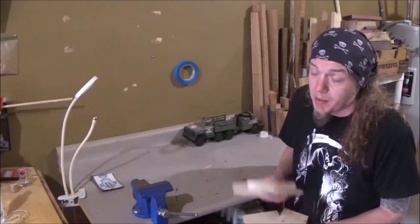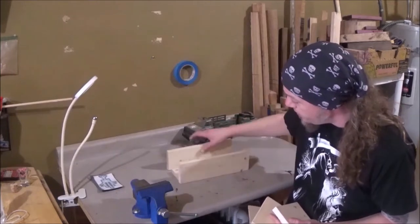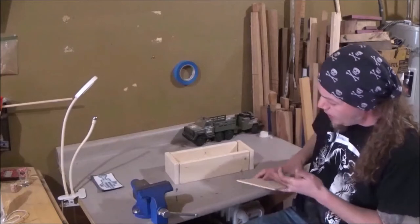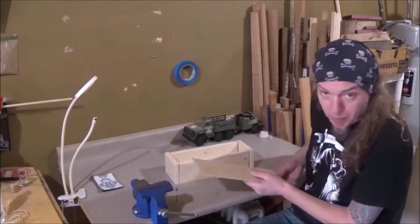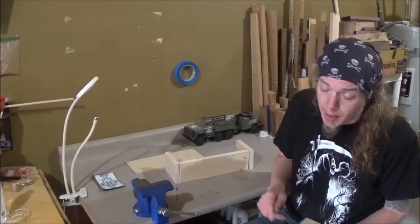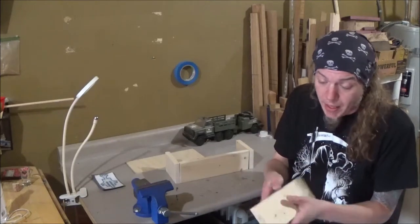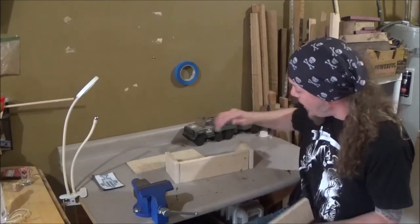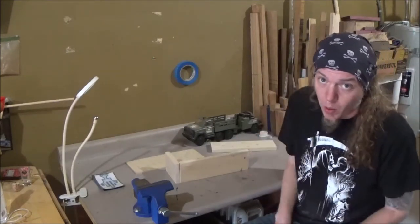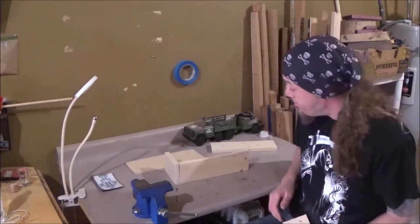So now that we got all the pieces, the basic principle of what we're doing is we're going to take these pieces of wood, set them up side by side, and put a wall in the center. This is going to go on a slide coming in from the top. I've already set the table saw with the proper depth. We're going to carve in channels. I did about a half inch depth down from the top. That'll create our slide mechanism. And then we're also going to have to shave this down so the slide has somewhere to go in and out of. So let's run it through the table saw and create our channels and cut this one down.